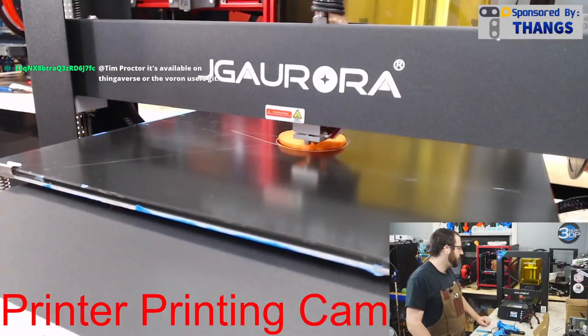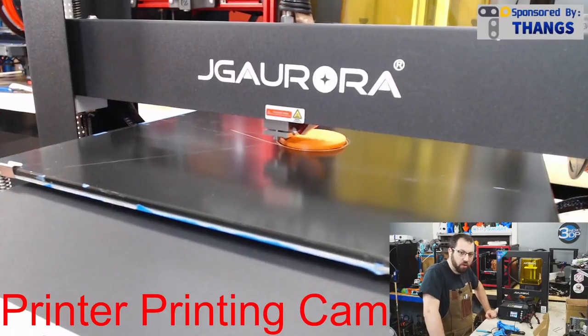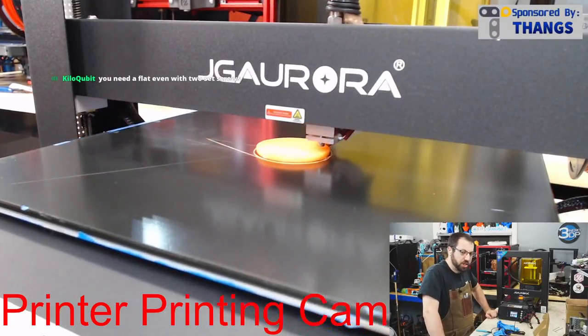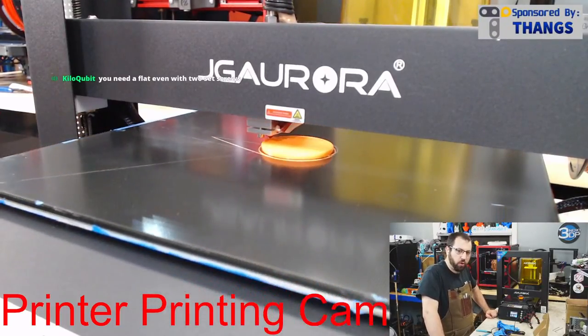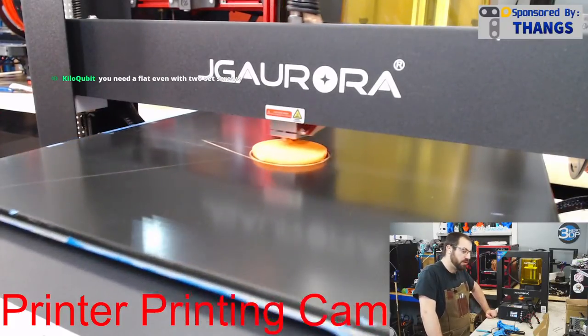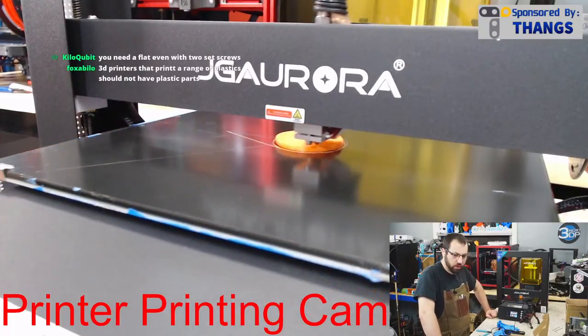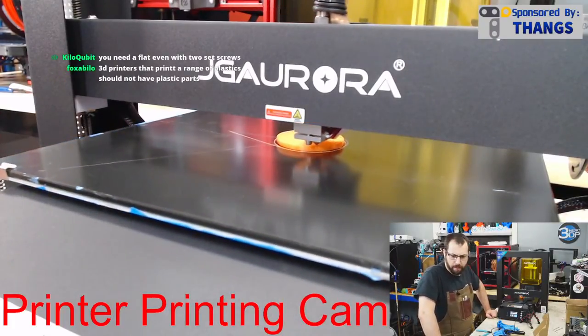I would say if you do want to print a printer out of CF nylon, print a test piece first. Put some tension on it, like load it up with a screw and check for creep over some time. Heat cycle it a few times if possible, like put it in a printer enclosure and heat it up, cool it down, and just make sure that your nylon isn't going to creep on you. So yeah.